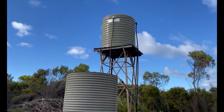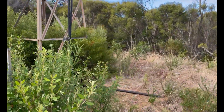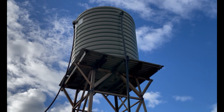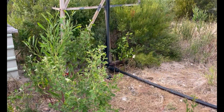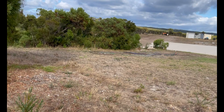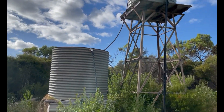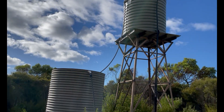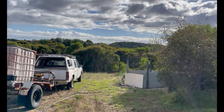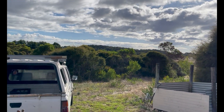So these are our two tanks — the ones we inherited. The windmill currently pumps up to that top inlet there, and there's an outlet at the bottom that runs underground back this way to the tap. We've removed everything else that was plumbed in, and we've just got a little overflow tank here. We're probably going to replace these tanks because they're both just a bit small for all the watering we're going to want to do when we reforest the whole block. It's about 10 metres height from back down the hill where the windmill is, but we've been assured that the solar pump will handle it no worries.